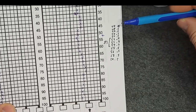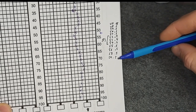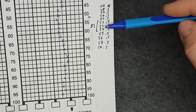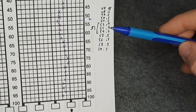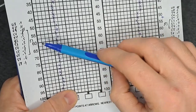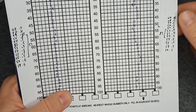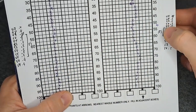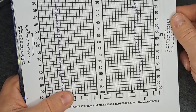Here for the right contact point it goes from 13.5 to 13.4, back to 13.5, and the gate is quite narrow, so that would look a bit promising, from 52 to 54, so the center would be at 53. We have a contact point of 13.4, so there might be a gate also at 53, because also here the center position is there. Basically also the contact area is smaller on this one, so this is a stronger indication. So let's do a wheel test on 53. I will explain what this is in just a second.